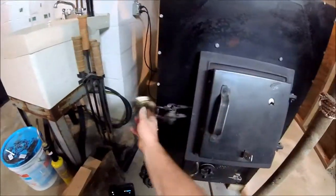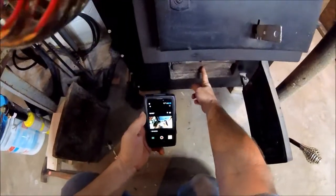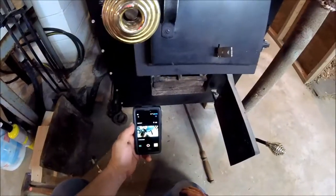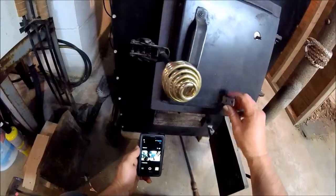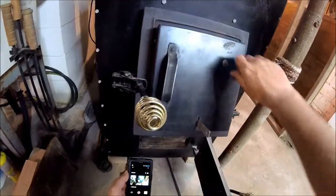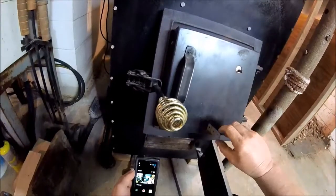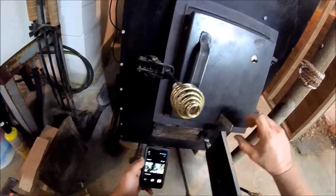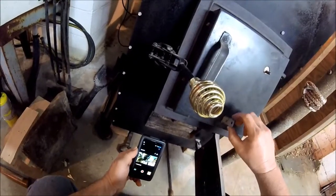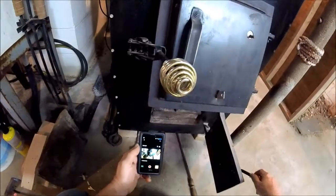Well, tomorrow night, I'm gonna cut this. I'm gonna cut me a hole here so this air can get straight through. There's another draft up here too. This stove used to have a thermostat thing with a knob, and they all break, so I made me a little, I got notches so I can set the draft at different settings, and there's all the way closed up here.